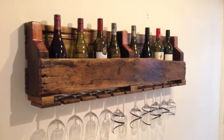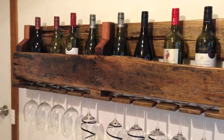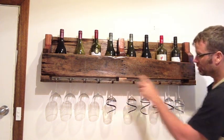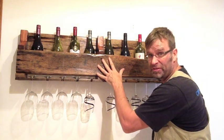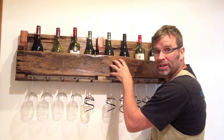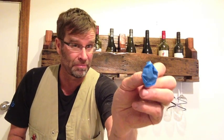So there she is, all varnished up. And I must say it's come up an absolute treat — very happy. Just a couple of quick things: first of all, the glass rack is attached to those three blocks simply by driving a couple of nails directly into them. Secondly, this is a fairly heavy unit, especially when those bottles are full of that beautiful red stuff. So the idea when hanging one of these is to locate at least two studs and screw directly into them. If you can't find a stud, don't panic — I did a video on stud detecting just recently using my homemade stud finder. Guaranteed success. I'll leave a link to the video in the description box down below, so make sure you check that one out.